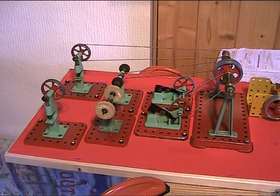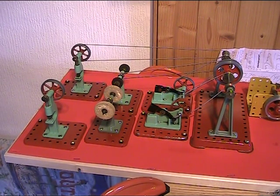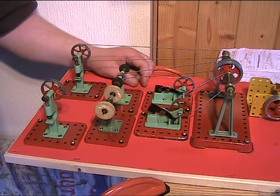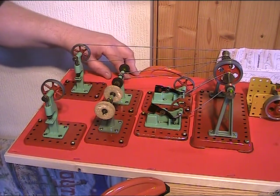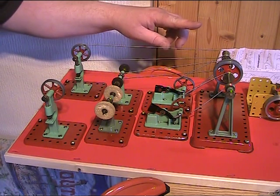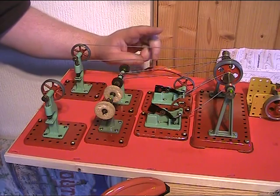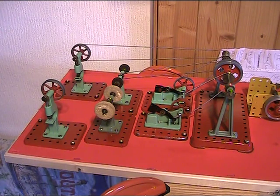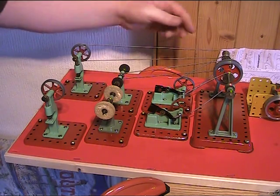As you can see folks, I've put some of the drive bands on, which I've had to make up out of several ones in some cases. 1 or 2 I've had to shorten from standard length, but others I've joined them and then cut them down to fit. As you can see, there's absolutely no way that standard length's going to fit across there. These 2 were standard ones just cut down. That was 2. Just about got away with 2 of that one joined together. And this is 2 but cut down. But I've only got 1 left. I cut the wrong end off the one as well. So at the moment I'm going to pop out in a bit to get some more,